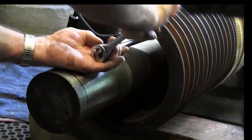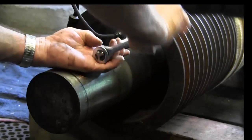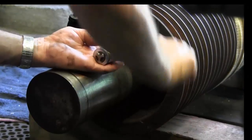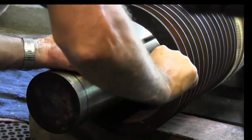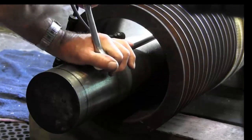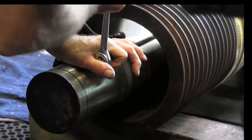And then I'm going to wire wheel the bolts as well. And then I will run the bolt in with Neverseize because I'm asking the threads to do a press or a pressure load to drive the thing off while I spin the bolts.